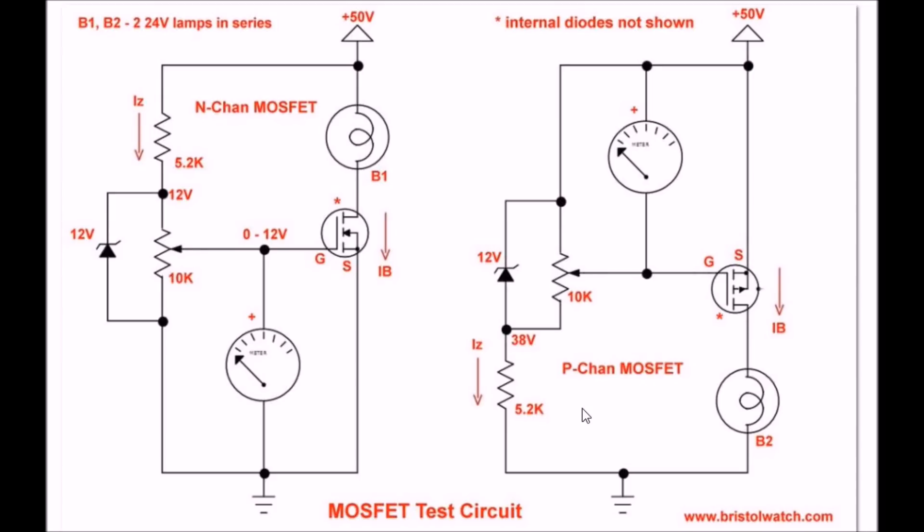Let's discuss these two test circuits. The one on the left is for N-channel MOSFETs, and the one on the right is for P-channel MOSFETs. The circuits are fairly simple, but there are issues to consider. I used a test voltage of 50 volts here, though I put out most of my H-bridges at 12. We need to look at how to operate these MOSFETs at higher voltages, because I got a recent request from a visitor who was using 90 volts. These same circuits will work on 90 or 120 — depends on the voltage ratings of your particular MOSFETs.